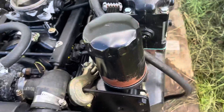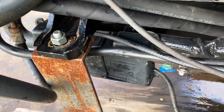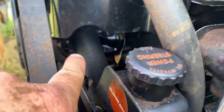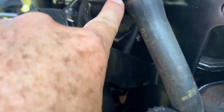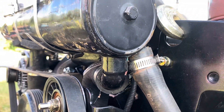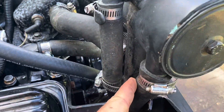On the raw water side, the raw water pump is right down here — driven by the engine. It takes up seawater through the bottom inlet, pumps it out the top, goes to the back, through your power steering cooler, drops back down, then goes through what's called your fuel cooler. This is a Cool Fuel cruiser — a fuel pump with a fuel-to-water heat exchanger in it. Then it comes out of there, comes up through here, and ties in right here — this is the inlet for raw water into the heat exchanger. The raw water always flows through the heat exchanger, comes out here, goes out through this tube into your exhaust, and out through the exhaust on both sides.